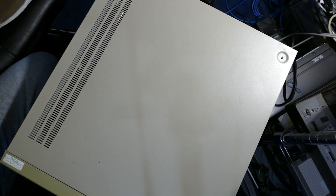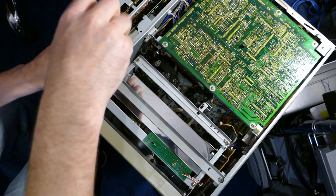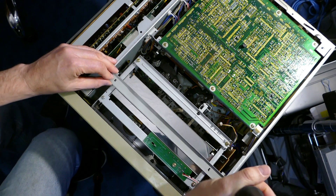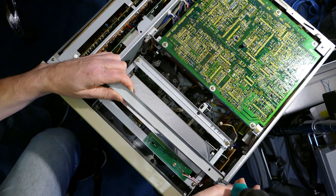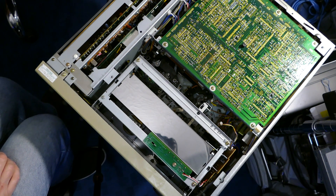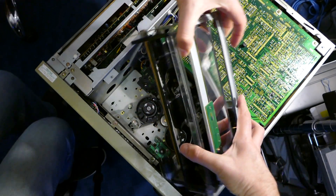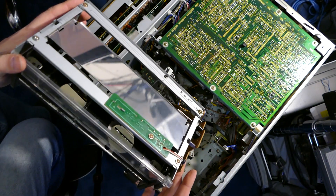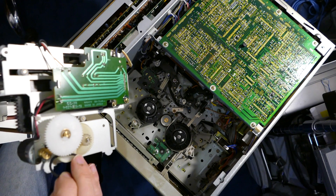First, let's take the lid off. Then we can remove the screws holding the spring-loaded bracket over the top of the cassette carriage. This cassette carriage has got to be the easiest to work on of any video recorder I've ever seen. Once it is free to move, there's a multi-way connector — easy to unplug on the right-hand side. The whole carriage then simply lifts out. The drive belt sits on the right-hand side and is easy to replace. If the old belt has snapped, it will probably be lying on the floor of the deck, so find and discard it.